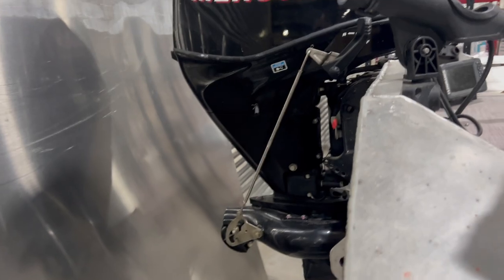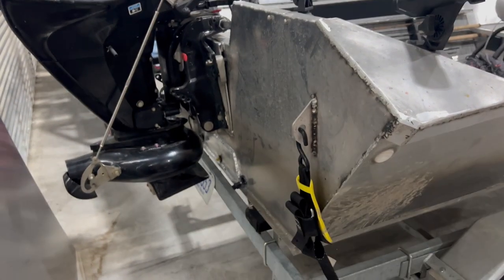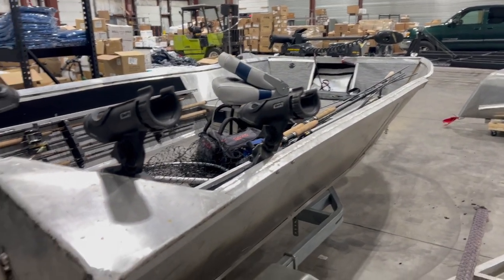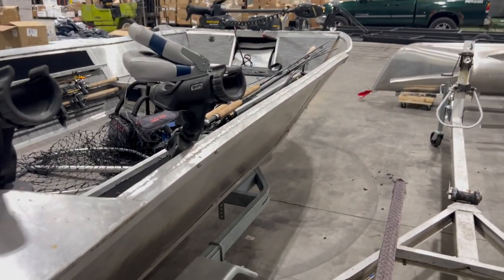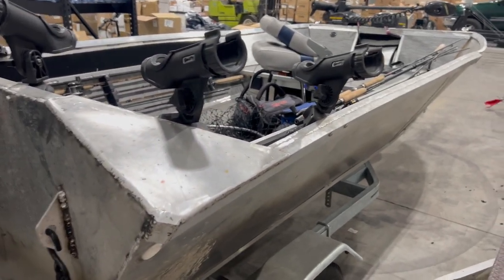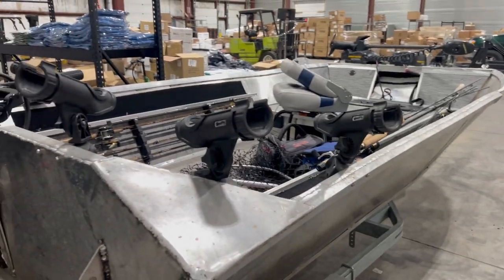It cavitated a lot, kind of kept me going slower, but I did close the tunnel, welded that shut, put the jet on it, and with just me and the dog in here, it was okay. But it's too overbuilt of a boat. So I'm gonna make a lighter version, still nice and wide, still nice and stable, but I'm hoping with two guys, it'll get me up the small rivers in a hurry and be a fun little boat too.